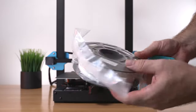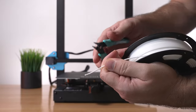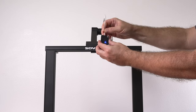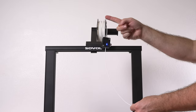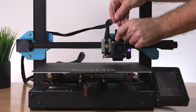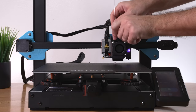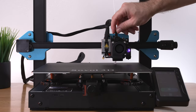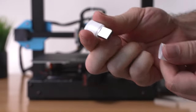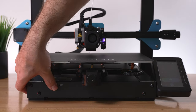Let's go ahead and load the filament using the white PLA that came with the printer. Cut the filament on an angle so it feeds easier. Put the spool on the holder and feed through the detector — it glows a little blue light as the spool feeds. Push on the arm and feed filament down out the hot end. It purges, and we push until we see white coming out. Very simple with direct drive. Let's grab the SD card with the USB adapter — even the SD card looks like the Creality ones — and plug it in at the front.